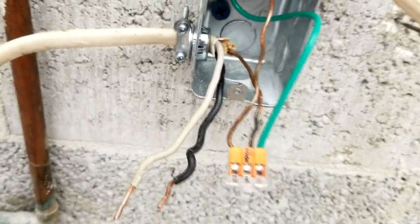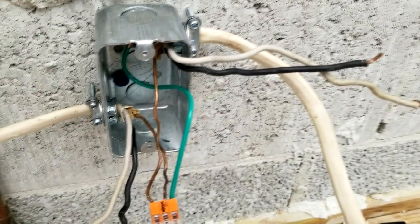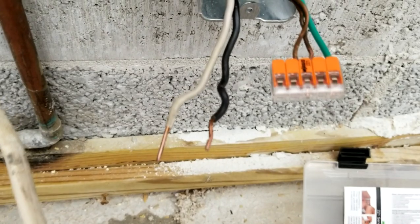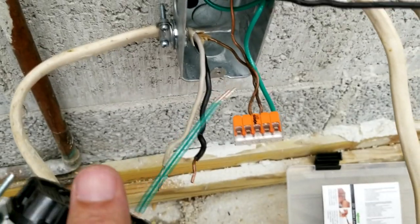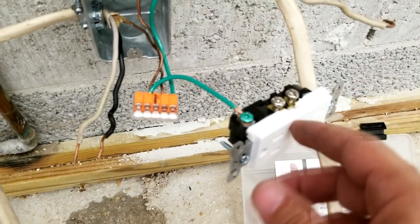They're all connected nicely. I'm just going to use my little wiring tool and tuck them all back in there, out of the way, so we can get ready to wire up the outlet. Here's the outlet — I've already attached the ground wire onto it. We had to switch this Wago connector to a five-port so we could accommodate one more wire; we didn't have any fours in stock, but they usually come in two, three, or five. So we're just going to hook this wire up to that one.